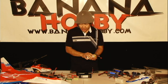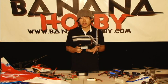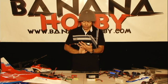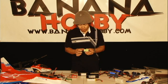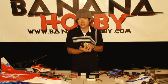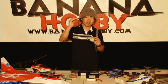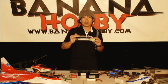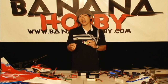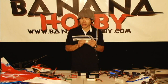That covers basically every single LiPo battery — from your 2200s to your 6-cell 3300s to your 6S 5,000 milliamp packs. This 5-cell 3700 is the same thing. It doesn't matter if your battery is from a Walkera or a little eSky helicopter at 7.4 volts, 800 milliamps, 10C discharge — same thing. You don't want to fly until your helicopter is starting to fall out of the sky. When you feel that happening, shut it down and recharge it. Figure out how long you were flying and next time fly about a minute and a half less than that, so you get the lifespan out of these battery packs.